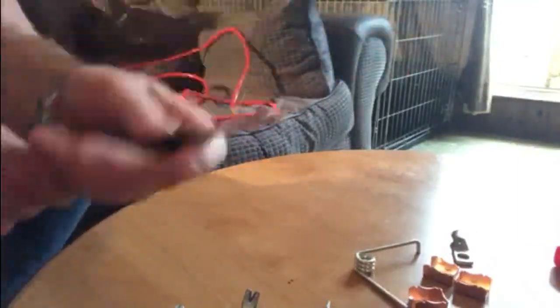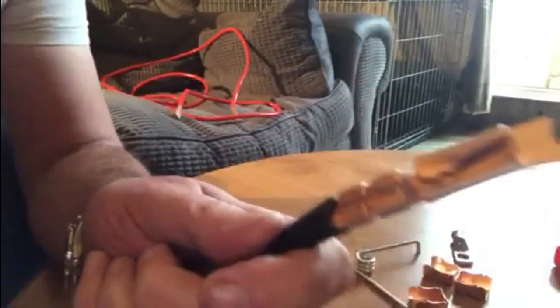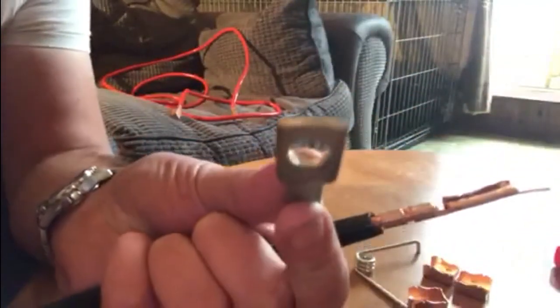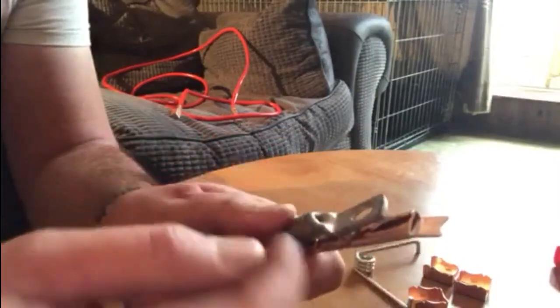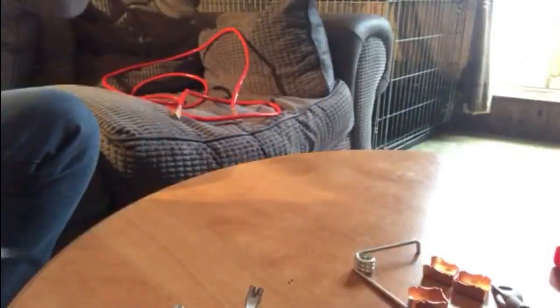If you need to take the end off or prefer to, just open up these sections with your screwdriver and take the copper end piece off altogether. You'd then be able to replace it with one of these — a standard battery terminal that you can get from anywhere. Slide that over the wires, clamp it in place, solder it into place, and then wrap a bit of tape around or put some shrink wrap around to the end. Then that'll go straight onto the board.